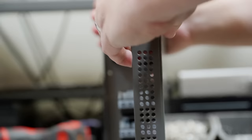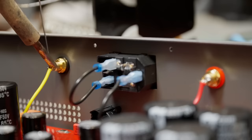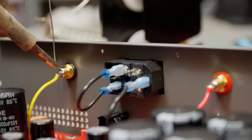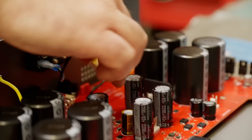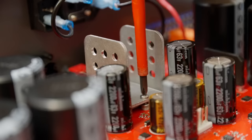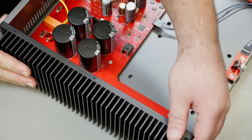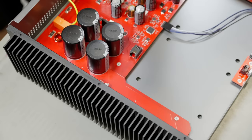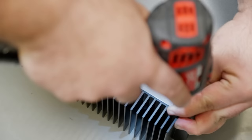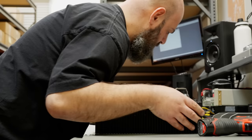Such as putting in the front panel board, and putting a small auxiliary heat sink onto the board with a thermal pad. From there, you actually get to the marriage of the heat sinks and the chassis. That's actually more important than it seems — the heat sink is actually structurally part of the chassis. They mount up the heat sinks, essentially mock them up, make sure that the clips go over the output devices, and then tighten up all of the output devices in sequence so that there's equal pressure and it's properly attached to the chassis.